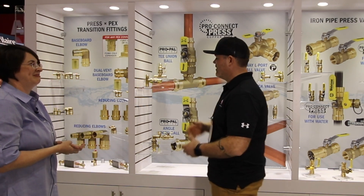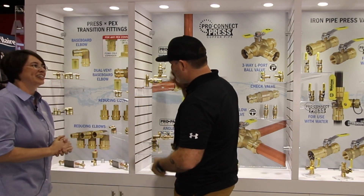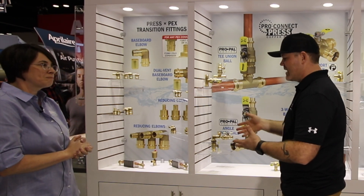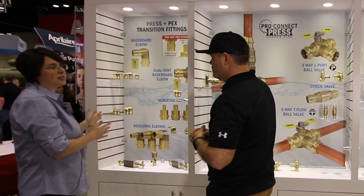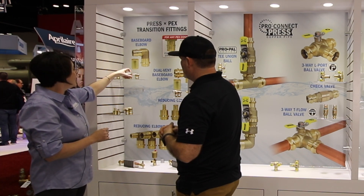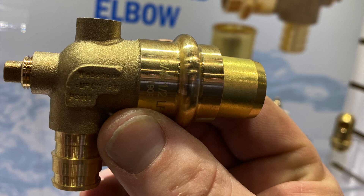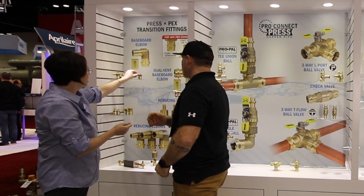You guys never stop. You've got a whole variety of new adapters for going from copper press to various types of PEX products. Those have been around for a while — have you added to that collection? We did add to that line. They've been incredibly popular, very well received by the market. This year we said let's focus on the radiator baseboards, so we added the connection sizes for that — three-quarter by half-inch from press to PEX, one-inch press to three-quarter-inch PEX — packaging them with the fin tube stiffeners. And we went one step further and are integrating two vent options. Depending on your application, if you've got PEX running in one direction you can install your vent there, or if press is running the other direction, just relocate the plug to the unneeded port and throw in one of the coin vents you've got in your truck and you're good to go.